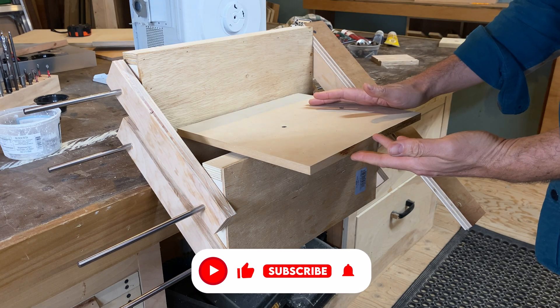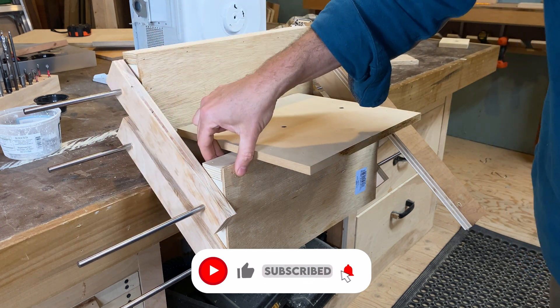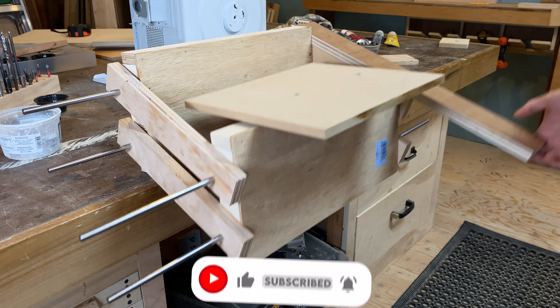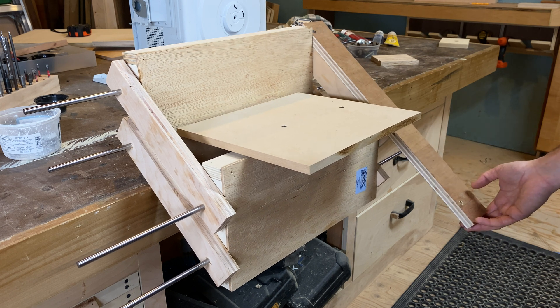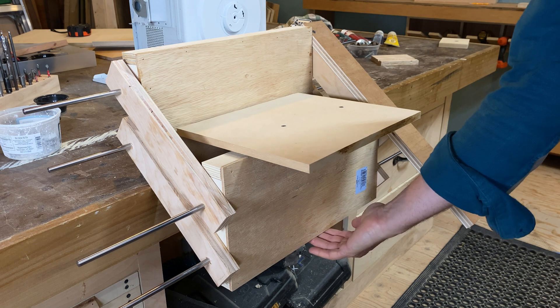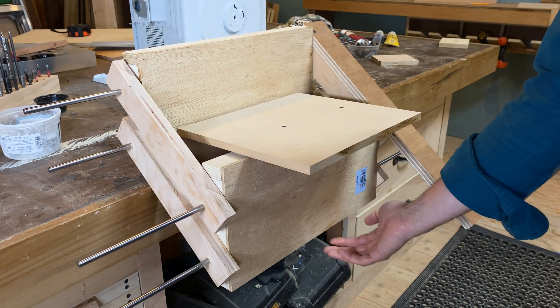This is the first prototype I made. It's a parallelogram mechanism with basically a little box on the front and back and a handle that allows me to lift it up. The handle is on one arm and when I lift that I immediately see that this thing is twisting. So the handle needs to be in the middle and that force needs to be applied there, directly under the garbage can ideally.